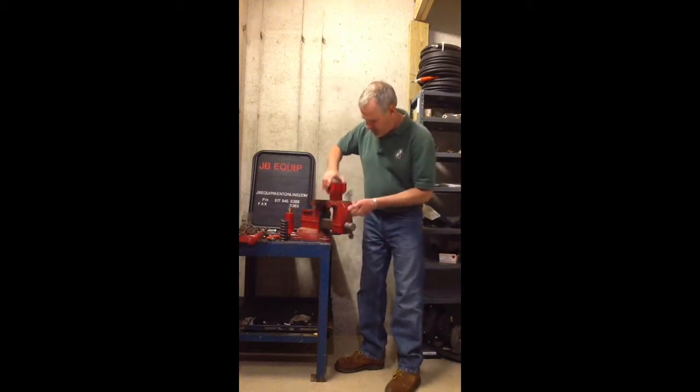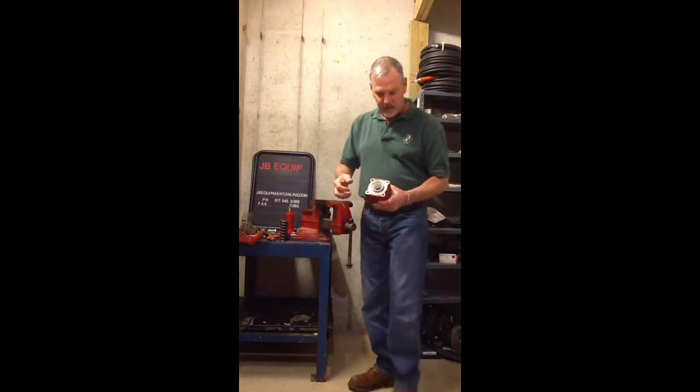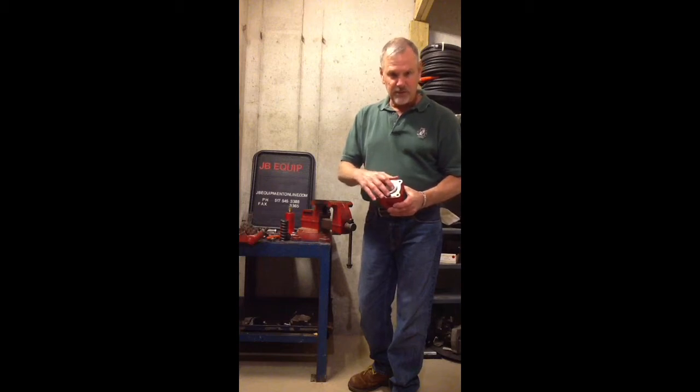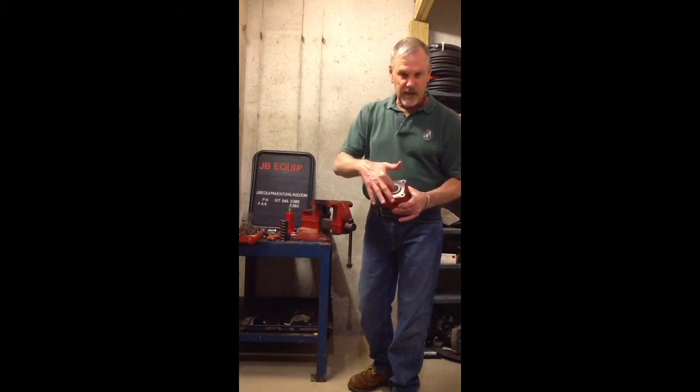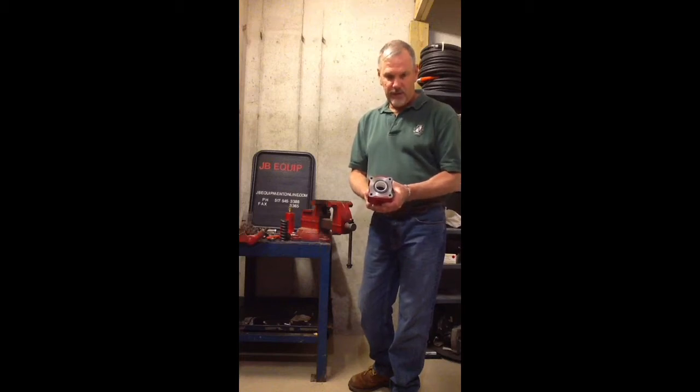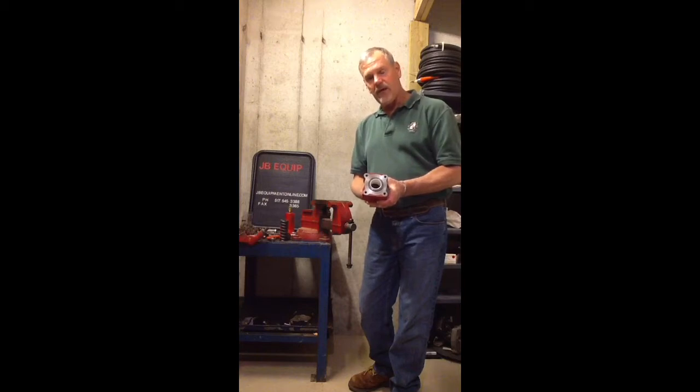After that you've got your bottom housing, and in that bottom housing you have a cylinder where your stem assembly goes down inside. Also at the very bottom you have the valve seat. One thing I'm always looking at when I repair a relief valve is whether that valve seat has what I call erosion marks across it. If it does, you're going to need to replace it.